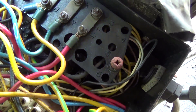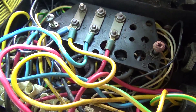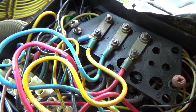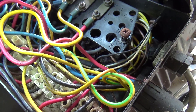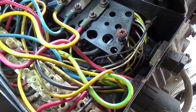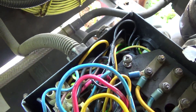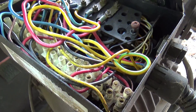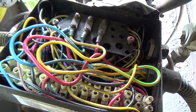On the first side we can see some burn wires. We've got three terminals on this side, under there where the push-on crimps, where the wires go in. And then we've got three on this side where they come out, so you can run them in star or delta. But it looks very wet in there, it almost looks oily, so I'm wondering whether the terminals have leaked. We'll get the cable in and have a look.